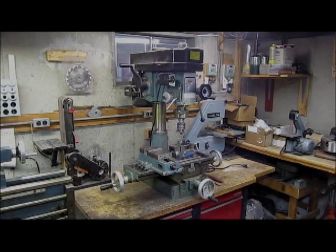My video will show you how a rough casting is surface drilled, threaded, and fit together. It shows how to make a fine flat surface on uneven sand cast metal. It shows how to locate assembly holes and screw positions exactly and easily. It shows how to thread a tap hole without breaking the tap. It shows how parts are made to fit together perfectly in assemblies.